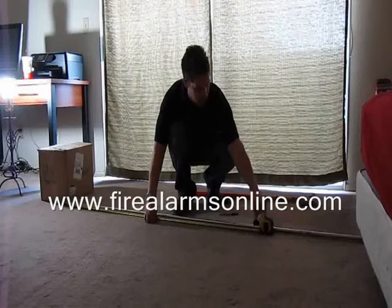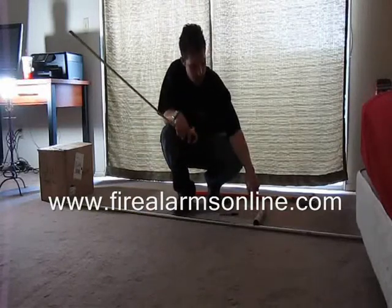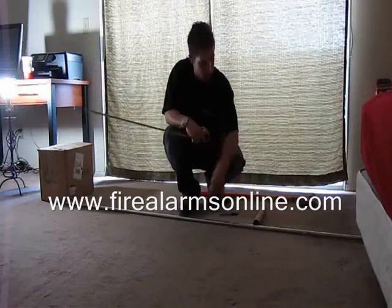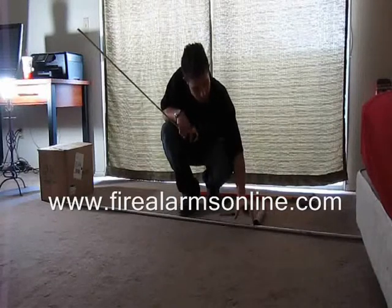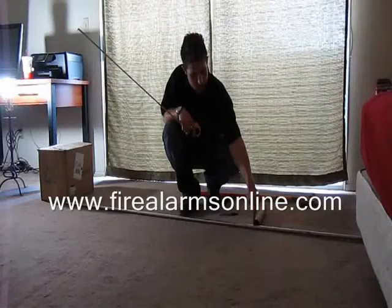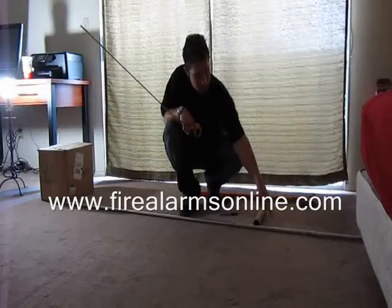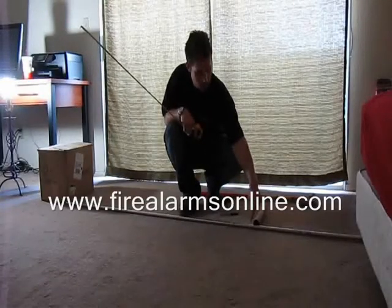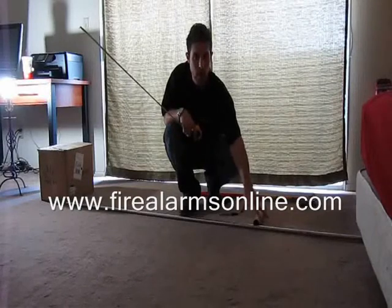With a two-inch height offset, the factor is five inches added to each side of that center point. You'll have five inches on each side from the center point. Your first mark using the notch on the bender head will be at 45 degrees, and your outside marks will be at 22.5 degrees using the arrow of the bender. The center one uses the notch, and the outside marks use the arrow on the bender head.